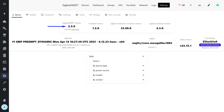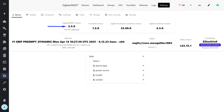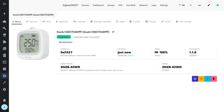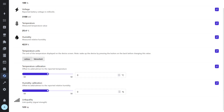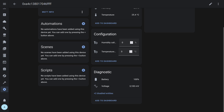Following the channel's usual tradition, the last system tested is the Zigbee2MQTT add-on, version 2.5.0 with stack coordinator. The manufacturer declared full support, and indeed that's the case. Complete information about the device is available, including firmware version and date, meaning updates will be available through the Zigbee2MQTT interface. In addition to temperature, humidity, and battery level, there's also battery voltage, which is how the battery percentage is calculated. Temperature scale toggle and calibration correction values are also available, and all parameters are passed into Home Assistant via MQTT integration.